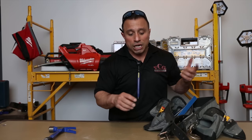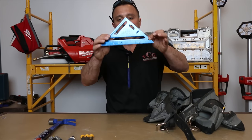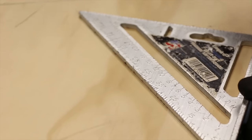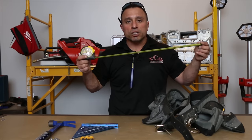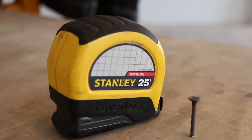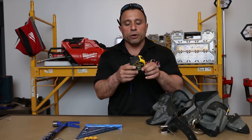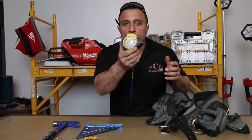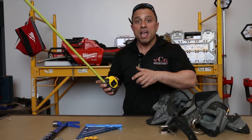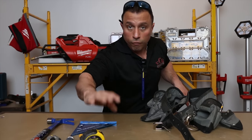As a carpenter's apprentice or a contractor's apprentice, it's always good to have some nail sets — I think you should have a set of nail sets. You definitely need a speed square; every apprentice should have one, and you can use it across multiple trades. I don't care what trade you're in, you're going to need a good tape measure. I like the Stanley Fat Max — this one's a 25-footer, not magnetic. Sometimes you'll find these at your local big-box store on sale, two for $20. You want something that's easily readable and has a long standout.